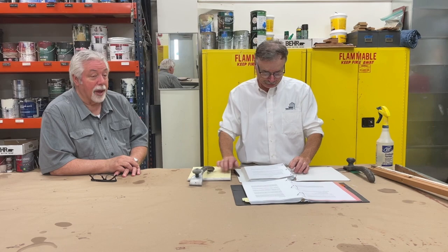Rule five: do not use a heat gun to melt lead paint surfaces because of the fumes. There's a heating tool you can use, but not a heat gun. Rule six: no food, no drink. Those who smoke, don't smoke. Be sure you're cleaned off and don't have any food around. When I'm working with lead-based paint, eating and drinking have to go away.